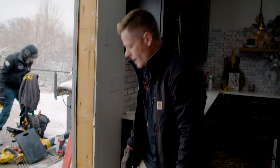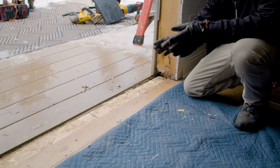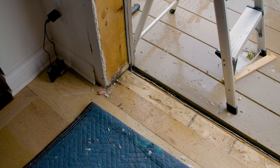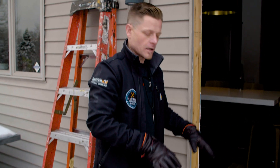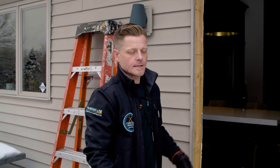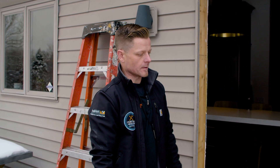We've cut the rot out. We've basically patched in some two-by-six underneath the subfloor and then ripped down some half-inch subfloor sheathing and went back over the top of it once we replaced the rotted wood. The next step is going to be to flash that bottom sill that we just replaced, and from there we'll caulk the corners all the way across the tape right before we set the door. The bottom sill of the door will get pressed into the caulk, preventing any water from going underneath the door. On the sides, once we have the door set, we'll use a closed-cell waterproof foam as an insulating membrane to insulate the cavity from the stud to the door frame, preventing cold or warm air from coming in and out.